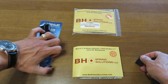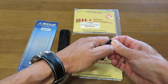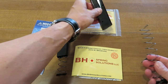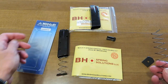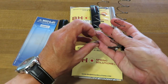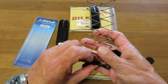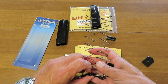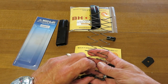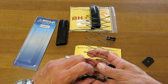These magazines were staged in advance to be taken apart quickly for this video. The first thing we're going to look at is the magazine spring — we're going to compare a new one here to the old one, and immediately what we see is a difference in the dimensional length of the one on the right, and that's fairly significant — pretty obvious what you can see there.